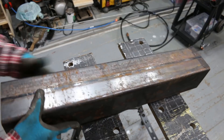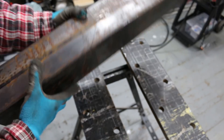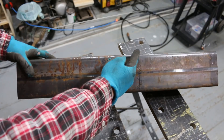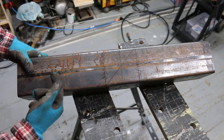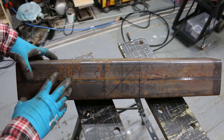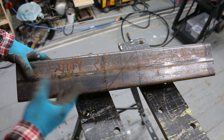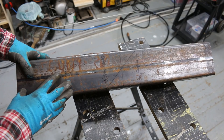What I have here is a four-inch by four-inch, one-eighth-inch thick steel square tube. I've already drawn a diagonal here — I'm going to cut it on the 45 so I get two pieces out of this two-foot length. I'm going to flip one piece around and make an L out of it, and this is going to be the wood-fired burner — a rocket stove — which will power the wood-fired oven. Let's cut this in half.